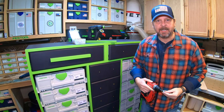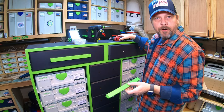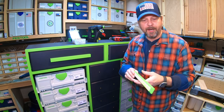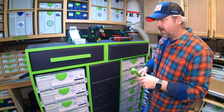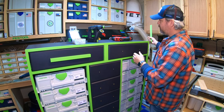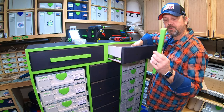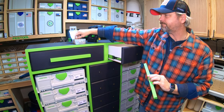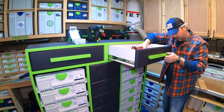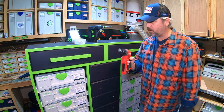We are at the finish line. Now I'm going to show you how I install these drawer pulls. All I did was take my three-quarter-inch material, rip an inch strip, and used a cove bit to create a little finger choil underneath to be able to pull the drawer out — simple as can be. I removed the temporary screws used to attach the drawer front and those holes are what I use to attach the drawer pulls, using some two-inch number-8 screws coming in from behind. I'm going to go run down and install eight more of these drawer pulls and we will be done with this build.